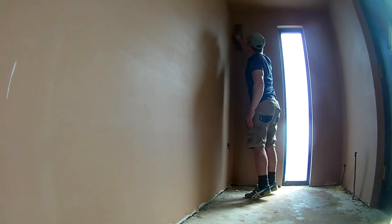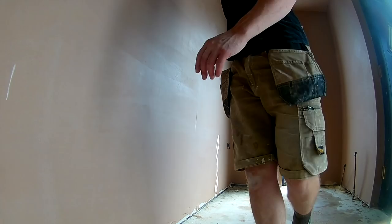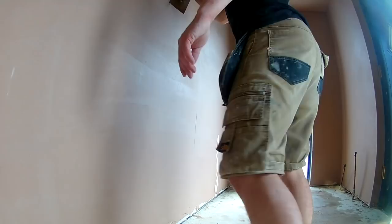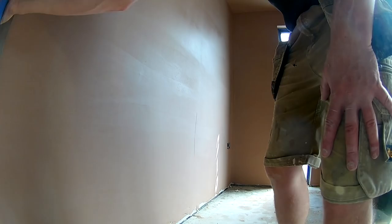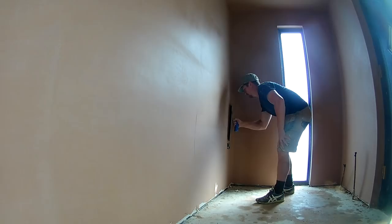As you can see, it's flattening nicely. My other fear was whether it'd react strangely — if it'd do something to the plaster or give it a strange effect. And I'll be honest, it's the exact same with and without it, except you've got more time. So here are the final timings — we're three hours 43 minutes in from one mix. I didn't mix two batches. Imagine if we did do two mixes, both with Extra Time — it'd easily take you to four and a half hours, probably five hours. My standard set is about three and a half hours, but following these guidelines we could easily be looking at four and a half to five hours for a hit.